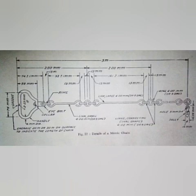The chain is composed of 100 or 150 pieces of galvanized mild steel wire, 4 mm in diameter, called links. The ends of each link are bent into a loop and connected together by means of 3 oval rings, which afford flexibility to the chain and make it less liable to become kinked. The joints of the links are usually open, but in the best chains they are welded so as to render the chain less liable to stretching.